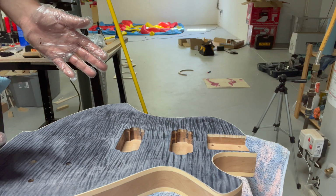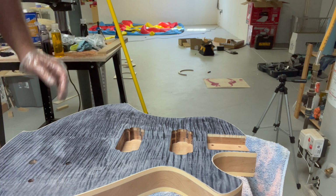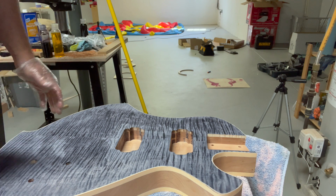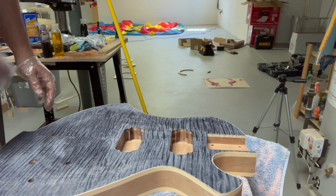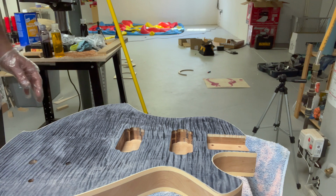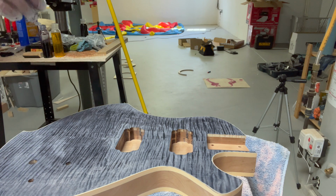I've probably said it a couple of times already, but I think this is just about as much as we can do. Eventually, you pack so much dye in that it really mutes the colors, so you don't want to spend too much effort putting layer after layer after layer. Eventually, it won't take any more stain, and it'll stop looking so good.